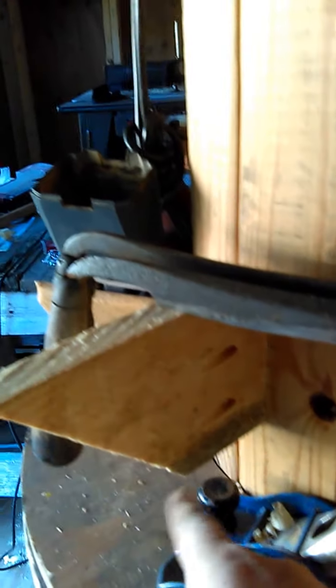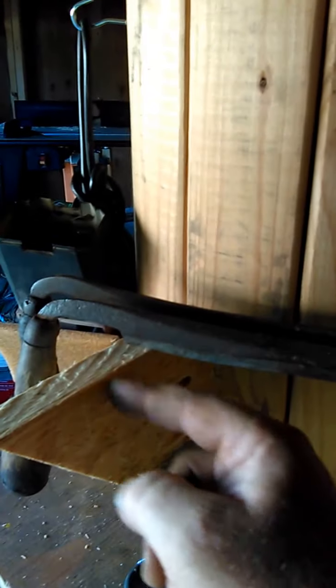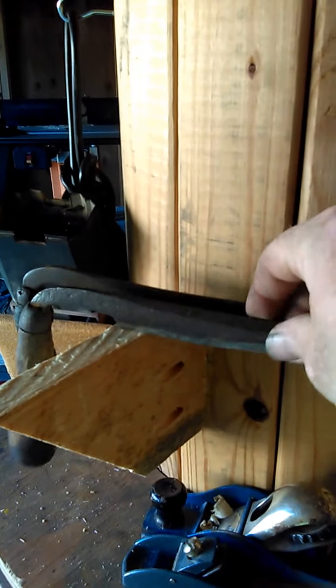And for this right here, for the draw knives, I went ahead and made 45 degree cuts on a board, and then I cut it down the side and matched these ends up, made sure they're the same distance, and then I used pocket holes to screw that into the back, and they're not going anywhere. If I bump it later on, what you probably could do is cut notches out of here, like V's or something like that, so these will sit right into them. But right now, this is just fine for my purpose.